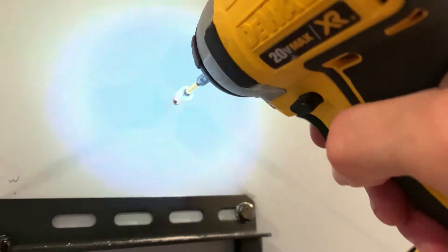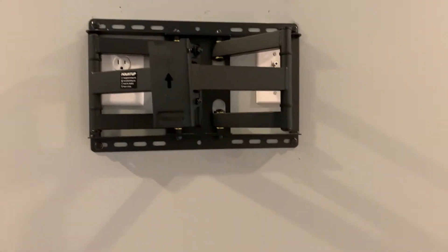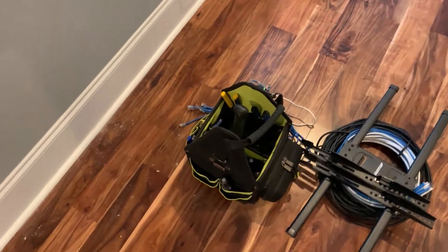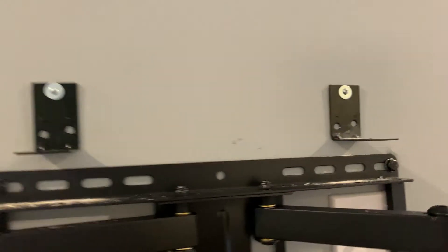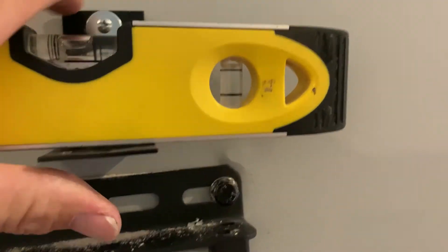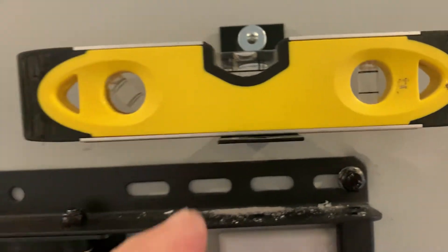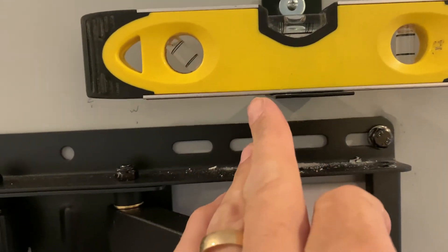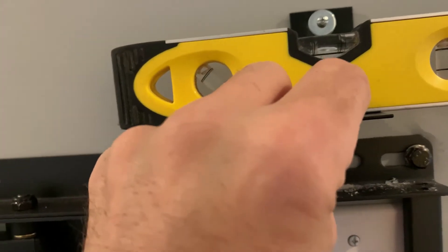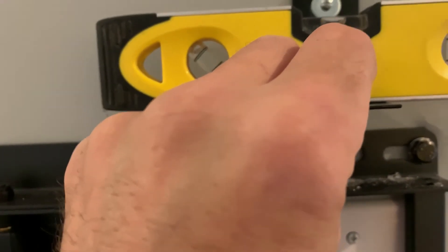I started in my pre-drill hole. You could drill it if you want to, but a screwdriver tip in sheetrock will usually just poke a hole in it. I'm going to put the top screw in — the screws are loose so the bracket will move around a little bit. I want to put a level on here. It's optional since it's behind the TV, but it has to be pretty close. If you get it too far off, you won't make good contact when you set your One Connect on there and it can be a little wobbly. That thing weighs probably seven or eight pounds, so it's not a light piece of equipment.